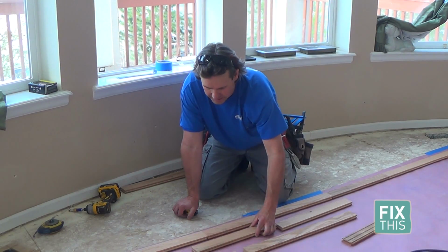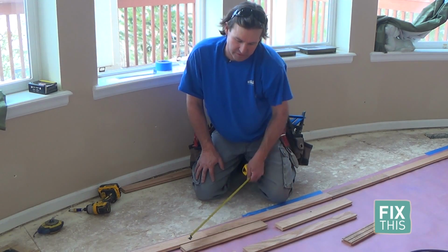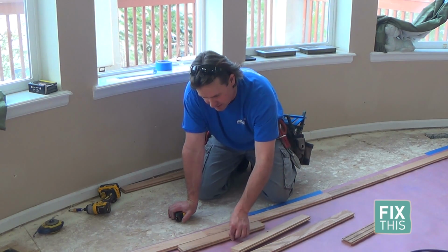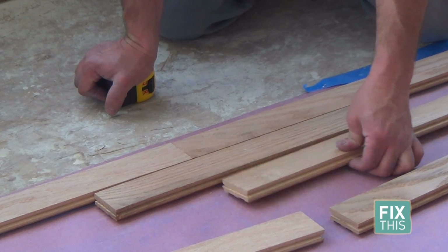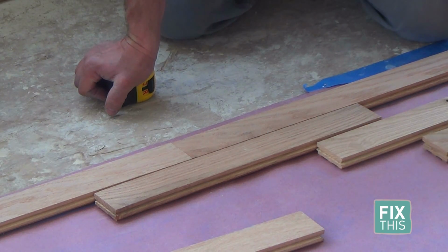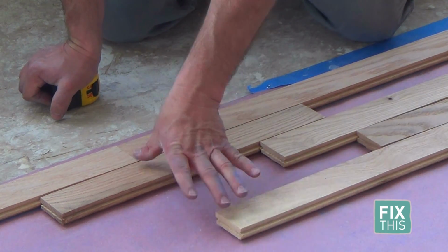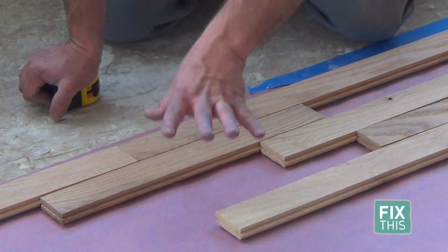When your pieces come in, you generally want to stay approximately about 6 inches away, so you don't want to stack seams. The other thing you want to not do is ever stack a seam like this. Stay away, and you don't want to do this either. So you don't want a seam within a seam generally. You want to either be like this or like this. And it's good to keep that pattern, and then you can come back after a few pieces, and if there happens to line up, that's acceptable, just not right away. We want to make sure that we have a few panels going.